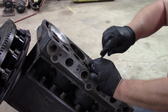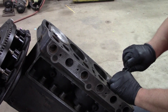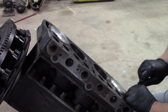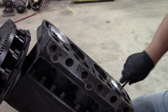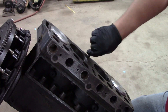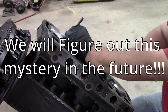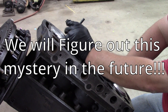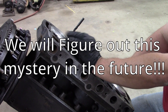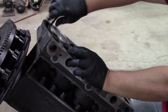It's getting kind of dark for morning here. We're supposed to have thunderstorms all day and all night. We're a little behind on rain but they're talking two or three inches at once — that's not gonna help. Most of these were pretty clean, which is good. When he took this motor apart it had a brand new head gasket in it, but they didn't do the valves, which is weird. They did the pistons — had it bored, new aluminum pistons 40 over, had all the babbit done. I suppose they just flat ran out of money.